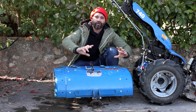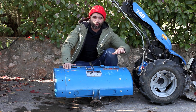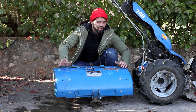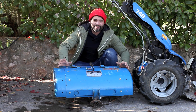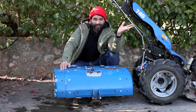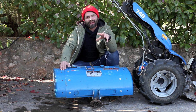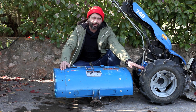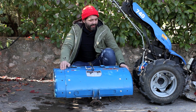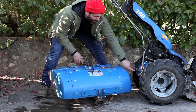Unlike a garden tiller, which moves forward from the motion of the tines digging down into the soil, this tiller doesn't want to go down into medium or heavy soil — it wants to ride high. So you have to put weight on it or push down on the handles, which can get somewhat tiring relatively fast. I would really recommend that for big tillage operations on an acre or two — or a hectare in metric — you have someone with a full-size tractor come in and do the heavy work, because otherwise you're beating this machine hard. This is not what it's designed for. It's designed for specialty cultivation — it's a precision tool best in certain applications. The tiller itself is really useful and good quality. I've had no real problems, though I have worn down the tines a fair amount — but they're replaceable. It's powered by the PTO. It's a bit of an art to pick the tool up and align the holes, just like attaching implements to a larger tractor.